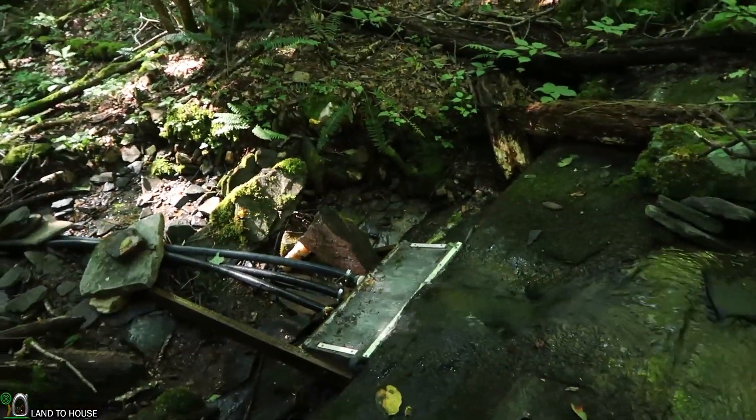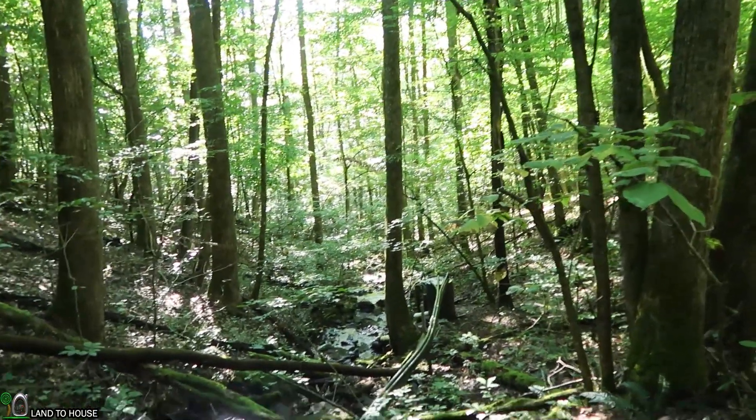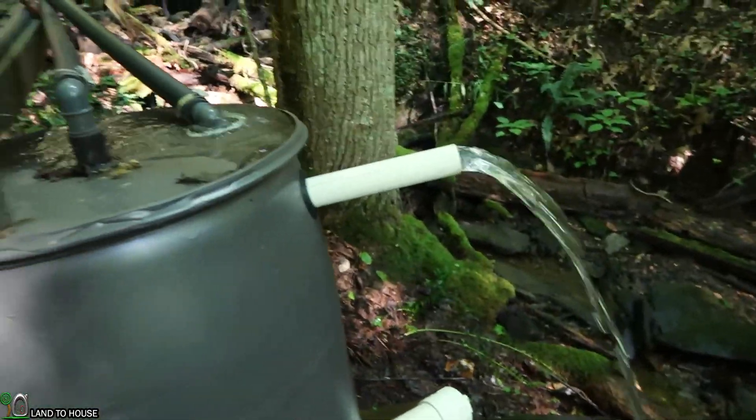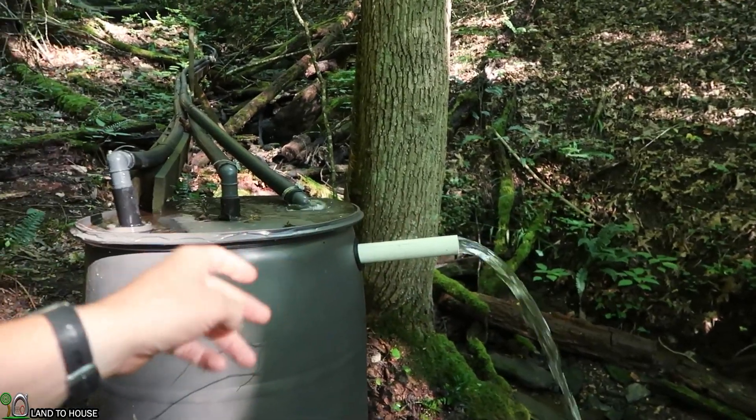So far, I'm really pleased with this inner tube. It seems to be catching the rest of the water. Let's go down here and see what the overflow of my silt catchment looks like. I need to bring a 5-gallon bucket up here to do some testing on my overflow. But currently, there's enough coming out the top of the barrel and over here on this side that I can still run one jet down at the turbine. I'm soon going to be replacing a couple of my quarter-inch jets or nozzles with a couple of 3/16ths inch, and that should allow me to fine-tune my water usage. If I turn on a single quarter-inch nozzle, it uses about 12 gallons a minute, and then I can turn on a 3/16ths and hopefully get my wattage up to 250 watts.